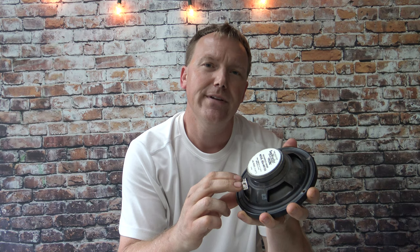And the wiring in there, they're both gold wires. So in order to tell which one's positive or negative, it's real easy. You need a good 9-volt battery, and then you need two wires, preferably with some alligator clips on one end. It kind of helps you hold them on the terminals. And if you just have two black, two red, whatever, it doesn't really matter, as long as you can differentiate which one is which. I'm going to show you how to figure out where your positive and negative terminals are on your speakers.